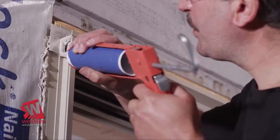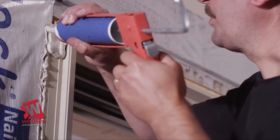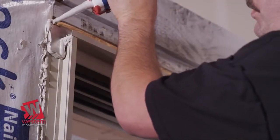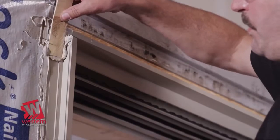Seal the back side of the applied corner sections at the top of each jamb, extending a minimum of 3 inches in each direction. After the corner section is in place, apply sealant over the top and tool sealant over all edges to ensure proper weatherproofing.